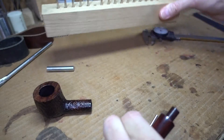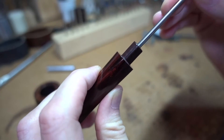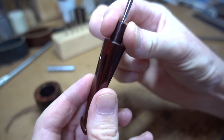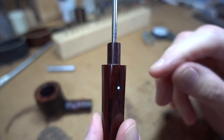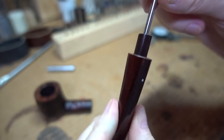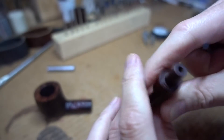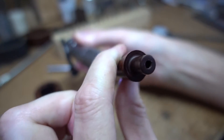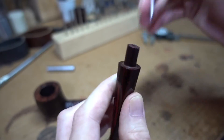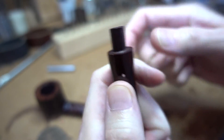You make a set like this one time and it's good for life. Choose the one that's the tightest that will still fit, and then you're within a thousandth of an inch or so. We're checking to see if this is still straight — if the tenon has been bent in relation to the face of the stem — and it looks like we lucked out. That is a good, straight fit. It looks straight when you do this — take a light and check it — but it's best if you can use tools or instruments to determine that. Given that the stemhole is square and the airway is straight...